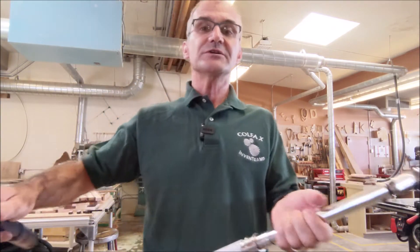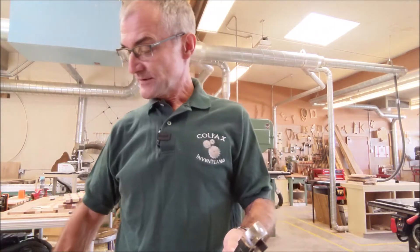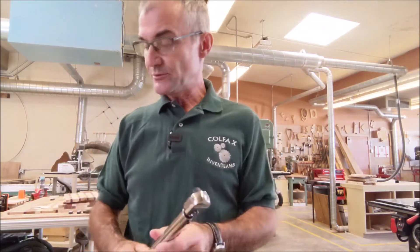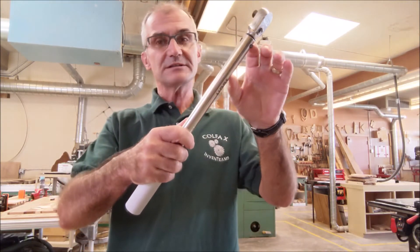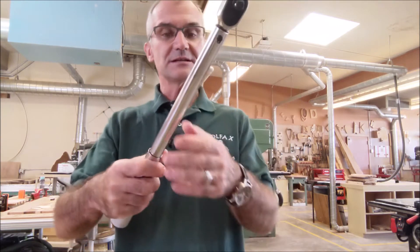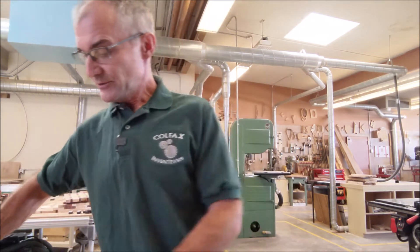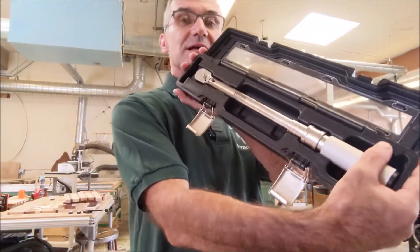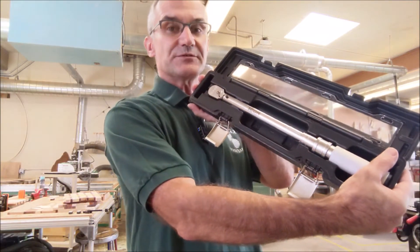These are not pry bars. You don't just drop them when you're done with them. They should always be turned down to the lowest setting before you put them away, because there are spring actuators in there. You don't want that spring under a lot of tension — it'll knock out the calibration. Put them in the box they came in and store them in a moisture-free environment.